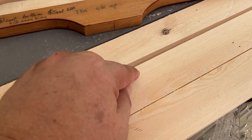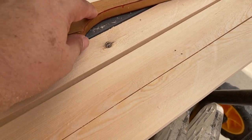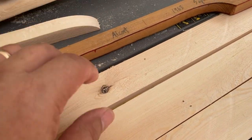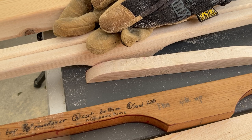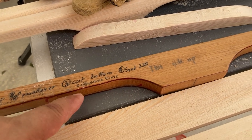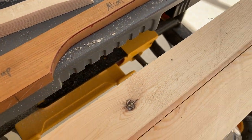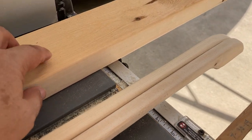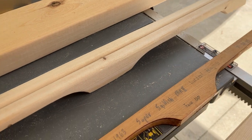We go along the top of the blank to round it over — it gives a better base for the router to glide along, as opposed to cutting the handholds first and then trying to route along that narrow shape. So the order is: cut the length, cut the width, trace it out, cut the top ends, route the top with the round-over, then cut the bottom. If you've got a good enough jigsaw and a fresh enough blade, you can actually stack them and do two at the same time — as our buddy Scott mentioned, you could trace it out and cut two at once, then rip them apart and have them all come out nice and symmetrical.